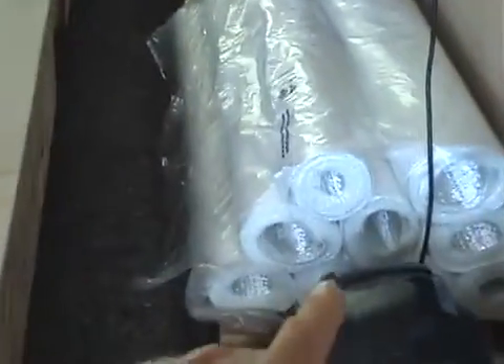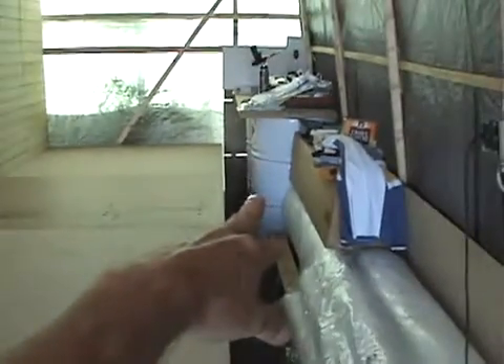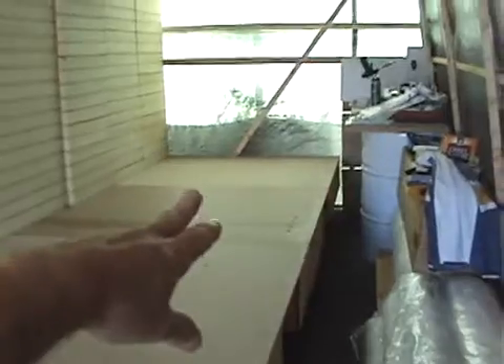What I'm going to be doing now is laying out all these four foot by eight foot floor sections. It's basically being laid down upside down. I've got some pre-cut rolls of fiberglass that I've already unrolled because the roll is really heavy — I made these all 28 feet long. Then I stretch out the fiberglass, roll it out over the floor section, and start wetting it with polyester resin. You can see there's one drum there — these are like 55 gallon drums and I've got a couple of those.